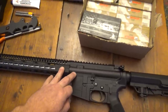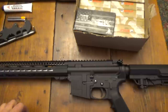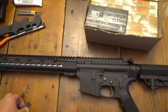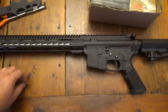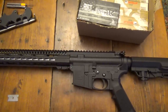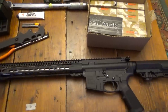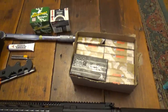One thing I want to tell you about building a 6.5 Grendel: stick with a Type 2 barrel and bolt. Don't mess with the Type 1s — there was a lot of inconsistency because some used the 7.62x39 bolt and the head spacing was hit or miss, with three or four companies doing different things. It was hard to find information on what bolts worked with what barrel. Stick with Type 2 and you'll be okay. Still, always head space everything — I know it's expensive to buy a head spacing tool you'll use once, but it beats blowing your hands off.